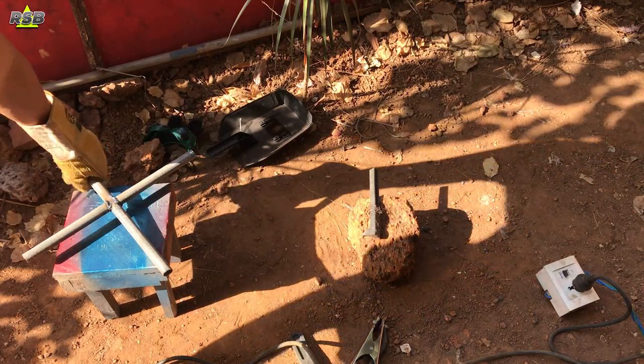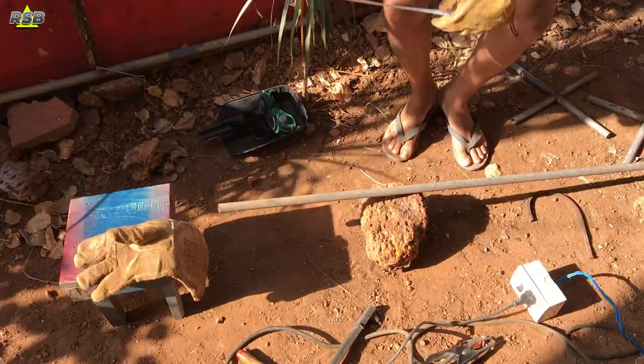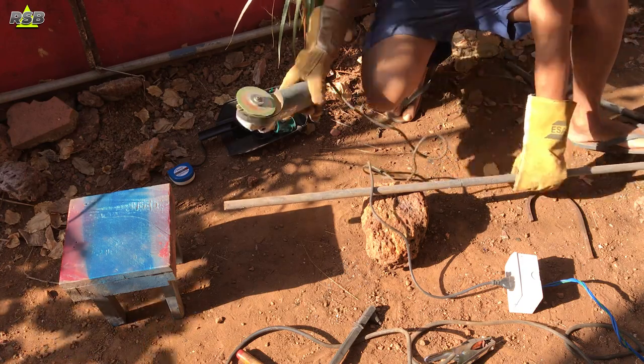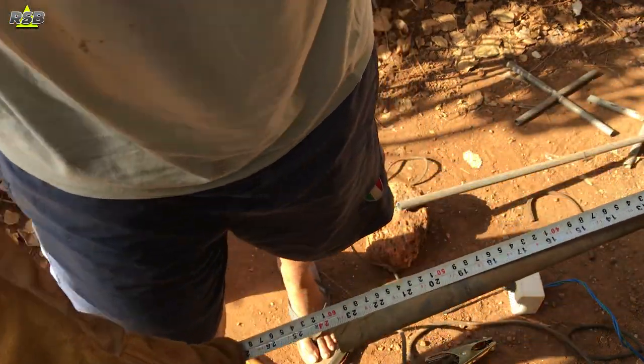Here my top part is now ready — I'm done welding it. Once you're done with the welding, your part should look something like this. Now I will make ready the pole. For that I will cut a 60 centimeter pipe. I have cut a 60 centimeter long piece, but on this pipe I will be placing my bearing cap, so I have come to the lathe machine to make the cup in which the bearings will fit.